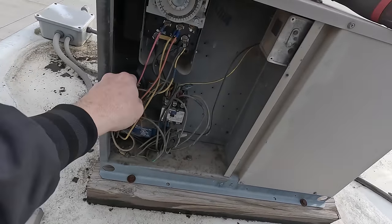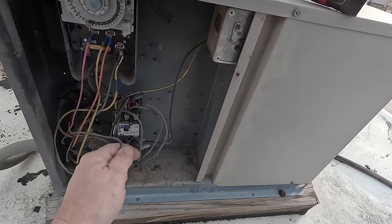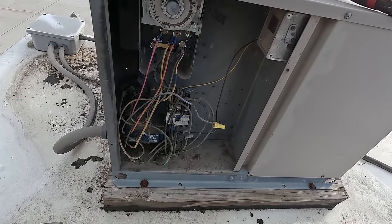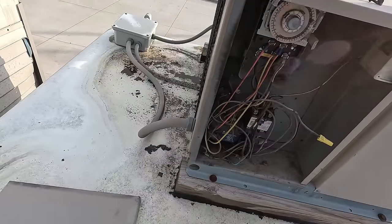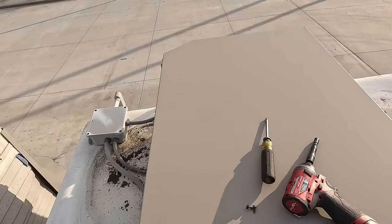Okay, there's your problem. X is not terminating because it's unhooked — for whatever reason. Defrost is set for 25 minutes. I don't know if it was terminating, false alarming, or what, but we're going to hook it up and put a new defrost termination switch on it. Power is completely dead on this thing, so let's make sure of that before we go tinkering with it.